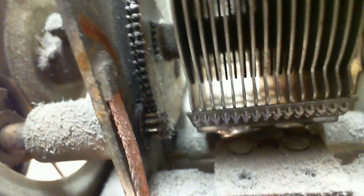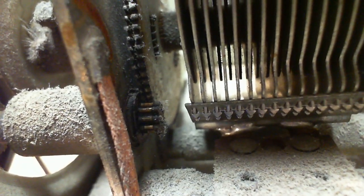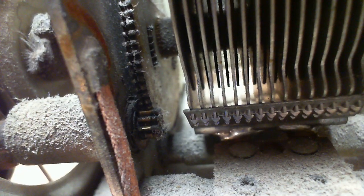So the string is driving the capacitor through this gear arrangement here. There, can you look on the big wheel gear? You can see the two springs kind of inserted right inside the wheel. So that's the springs that are affecting that gripping action that I was talking about, which occurs right down in here, giving you zero backlash. So there's never any play here. Except the string. Inevitably strings have a little bit of stretch to them. So your actual original drive is with string. Heavy duty double string.